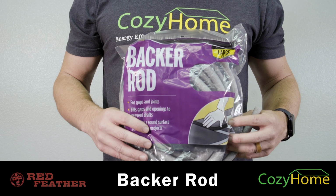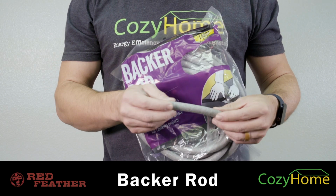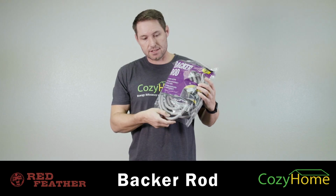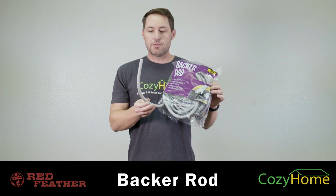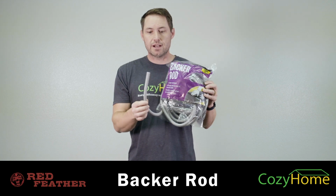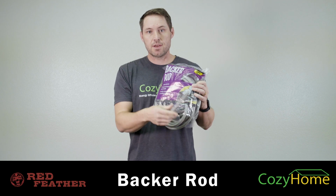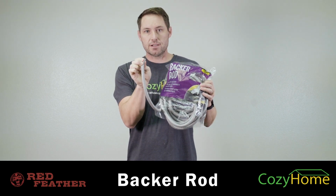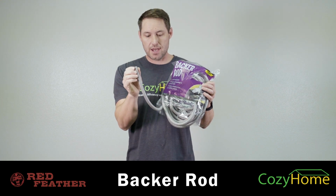This right here is called backer rod, and what it's used for is to seal up gaps where you have maybe a spot that you wanted to use some caulking on, and you can stick this into the gap before you use the caulking, and that will help make the caulking have something to push up against so that it works more effectively. You can also use this without caulking if you need to just seal up a random gap. It's really squishy, and it springs back pretty easily, so you can push it into some pretty small gaps, and then it'll expand and fill those gaps.